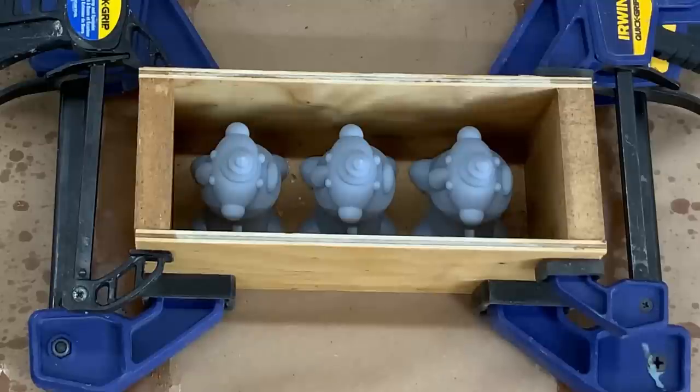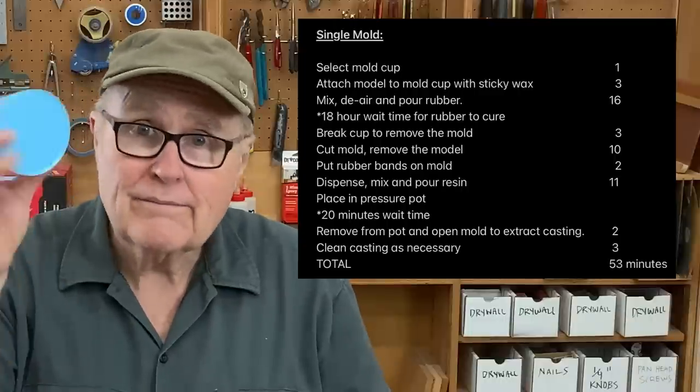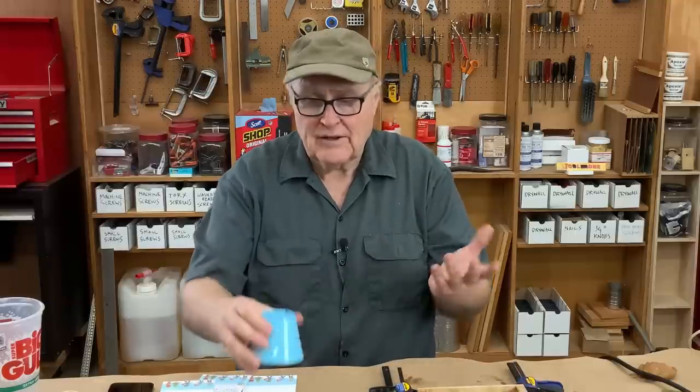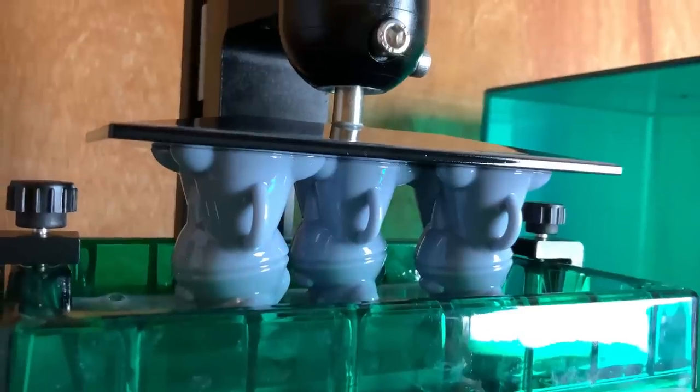At this point in the project, we can estimate how long it's going to take to make the cast versions versus the printed versions. The first thing we can say for sure is that it takes a lot more upfront work to make cast resin versions because you have to make the mold. I added up all the steps and came to an estimate of about an hour total for making this mold, and maybe an hour and a half for making the box mold. Those are pretty heavily padded estimates — my actual time was less — but I've learned that anytime you estimate something, you better double it and add 10% to have a realistic chance of being close. But it's when you have the molds made and get to actual production that there is a huge difference in speed. Each one of these parts took an hour and 14 minutes to print, but with this three-gang mold I can cycle it twice per hour.